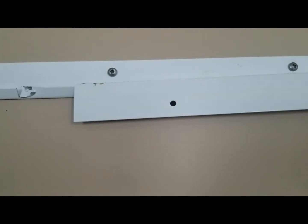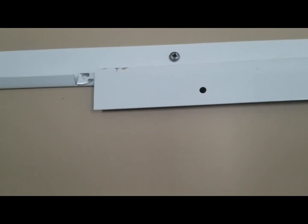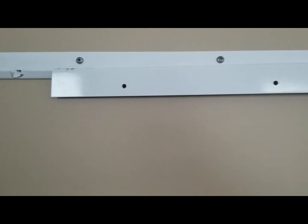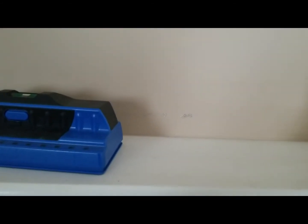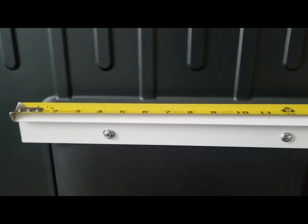Once you hang the TV and slide it, it's not going to go anywhere — the notch serves as a stopper. I also measured how wide I can go so I can slide the TV left to right to center it, and the same thing on the other side — it won't go anywhere. Of course, you also have to measure the height because I have a mantel here for the fireplace, and I was able to measure it almost perfectly with about a half-inch gap.